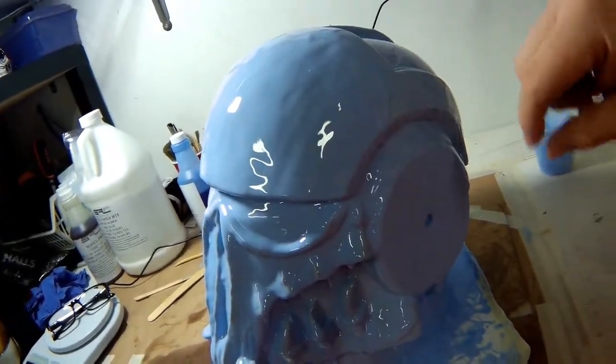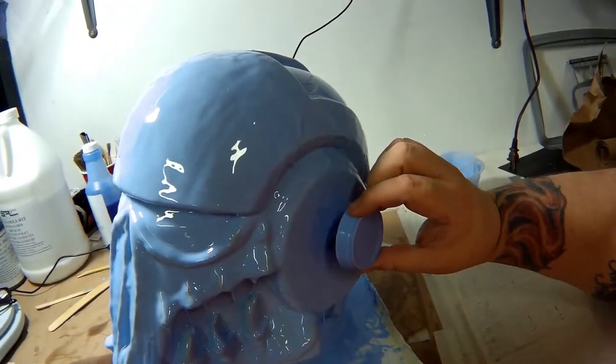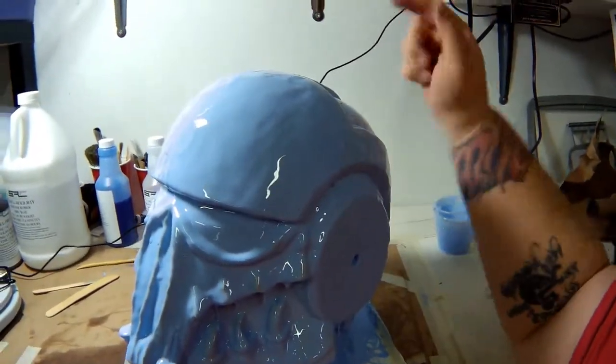Probably set one on each side. Just that way, because, like I said, I'm going to go in half right up over this way, so I'll basically put one right there, so that way, on each side, I have keys front and back on the top. And then on the front faces here, and on the back side. It helps hold the mold in to the mother mold when you go to rotocast. And maybe I'll show a separate video of me rotocasting a resin blank of this.